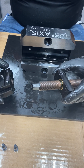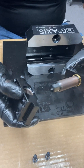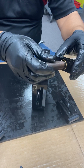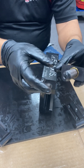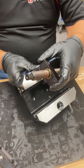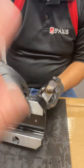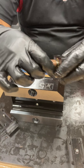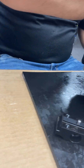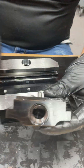Since they're all pre-centered, now we're going to assemble the left and right trucks. Very important — the vise does have a right and a left side. The right side of the lead screw has a hole in it with a specific truck guide that goes onto that side. The other side does not have a hole. The left side shows the torque value, and the lead screw on that side has no hole indentation. So right side and left side are very specific. Each truck is specifically marked — this one has an R for right, this one has an L for left.